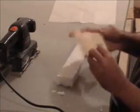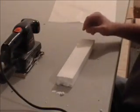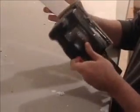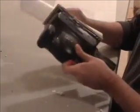I've allowed the lightweight spackle to cure for about an hour and fifteen minutes. I'm going to go ahead and put on a fresh piece of 220 grit on the one-third sheet sander and just sand it down. Get rid of any high spots — you don't want to really go into the foam. Just take off the high spots that you may have left as a result of applying the spackle.